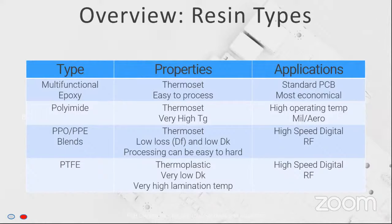This slide is an overview of the resin systems traditionally used in PCBs. Multifunctional epoxy systems went through an evolution around 2006 when lead-free assembly became popular, but they're still used today — those are phenolic-cured epoxies. Polyimide has been around for a long time. The PTFE systems at the bottom have been used for RF applications and high-speed systems. Now we have polyphenylene oxide — sometimes called PPO systems — and PPE blends that allow us to get to PTFE electrical performance without some of the drawbacks.